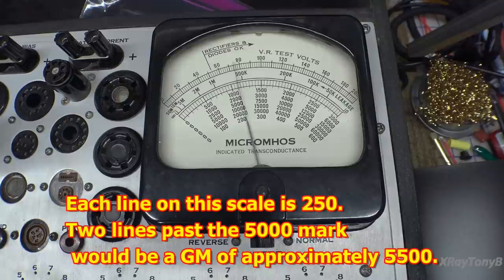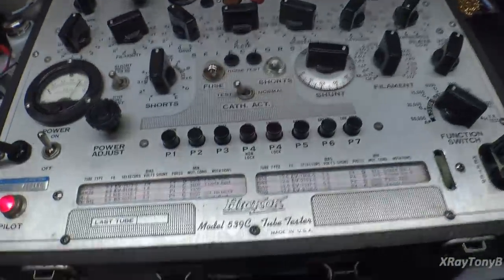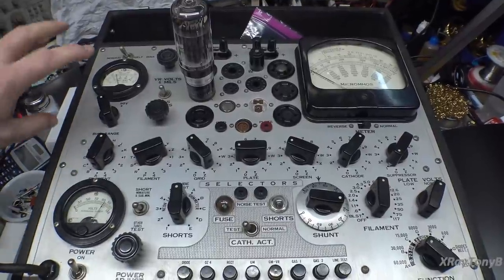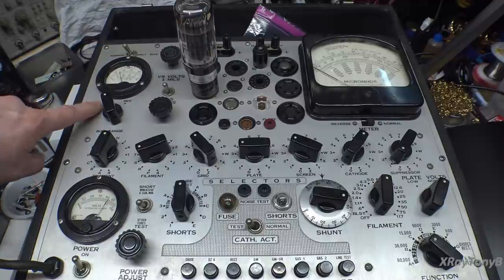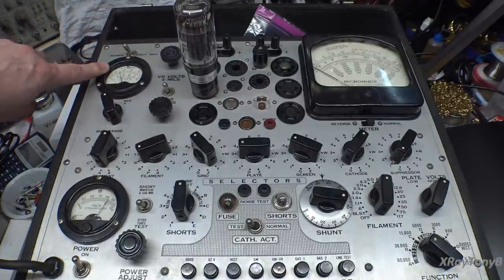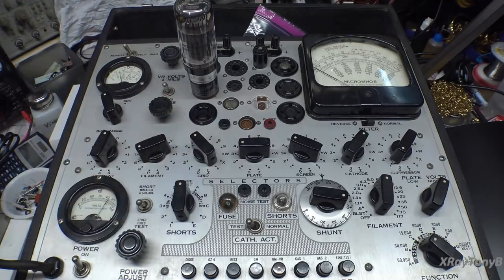You can see that's very close. There are different versions of this meter. The 539B and C — if I remember correctly — the actual bias voltage is just picked off the transformer AC, and you're using this rheostat here, this big pot, to adjust the AC drive voltage. So you're actually putting a 60 Hz AC signal onto the control grid, which the meter averages out. It's not a big deal. Now I'm going to show you another meter that is considered slightly a little bit better — let's take a look at it.